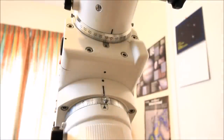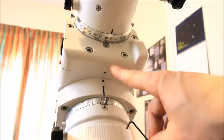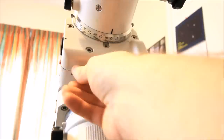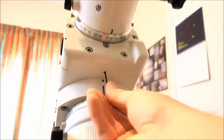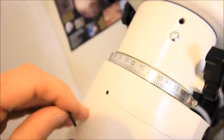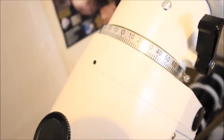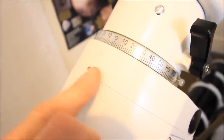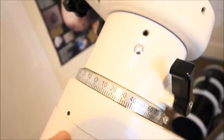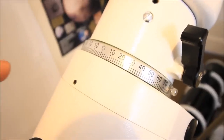The next step is get your 2mm Allen key and where the grub screw is, the 2mm grub screw, you slacken this off, like so. You then go to the top, crack off the top one, like so. So both bolts are loose and the plate should move up or down. So remember, when you tighten this one up, you're pushing the plate up.